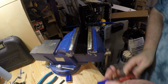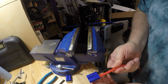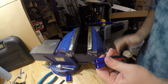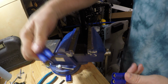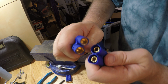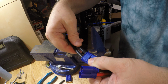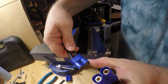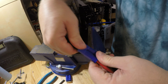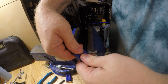Okay. So now we've got the connector on. It's into place. The red is positive, black is negative. And to show you one of the ends of the cables, this one here is an end that has the females, this is the male, and the side with the flat side and then rounded sides, flat side is positive. And they just slide together just like that.